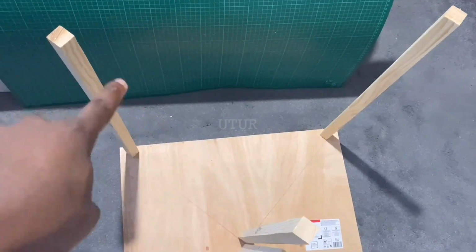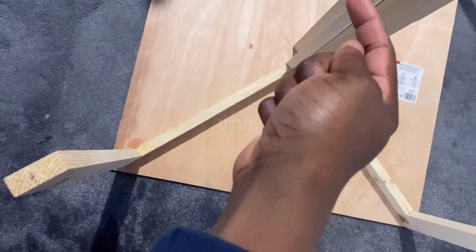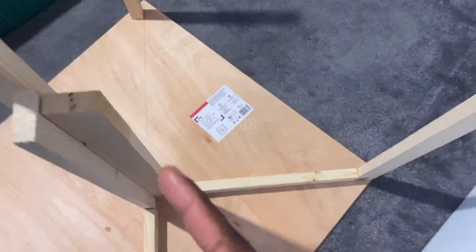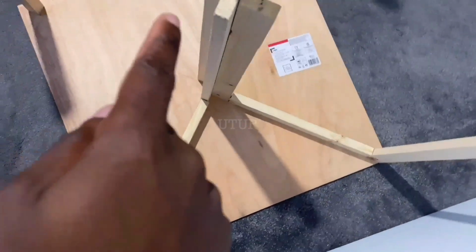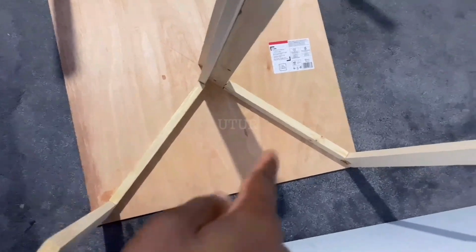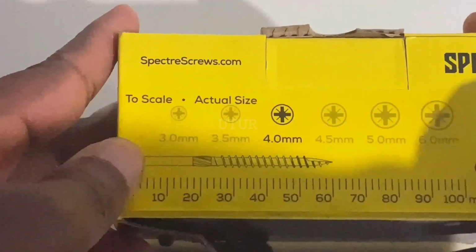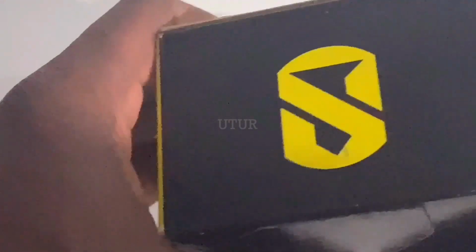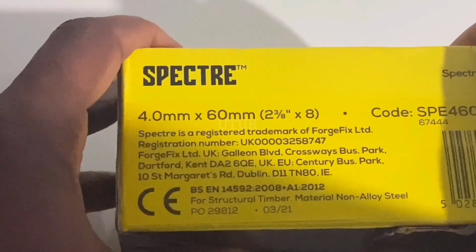And like I said previously, we're going to attach or fit the diagonally cut hardwood plywood onto the top of the housing and pine wood structure, as well as the base. So the process would be, cut the hardwood plywood into sections using a circular saw, and then subsequently pilot drill the pine wood with the drill bit, then open up the hole and then screw the diagonally cut sections onto the top and base of the housing structure of the bass trap.